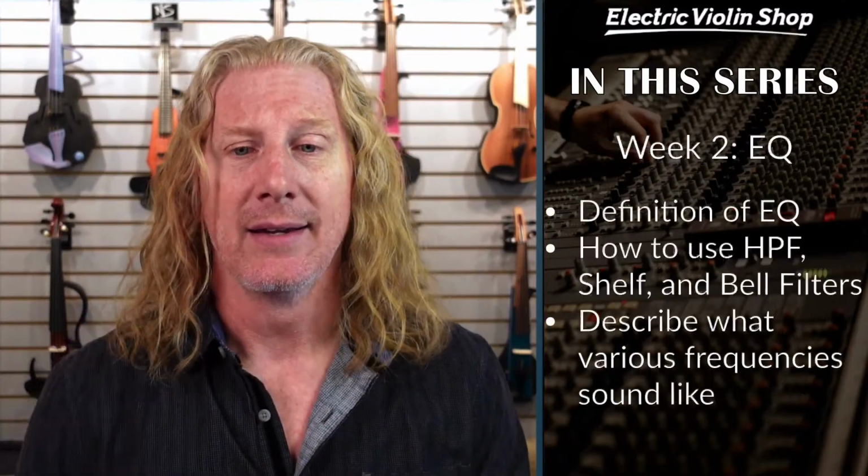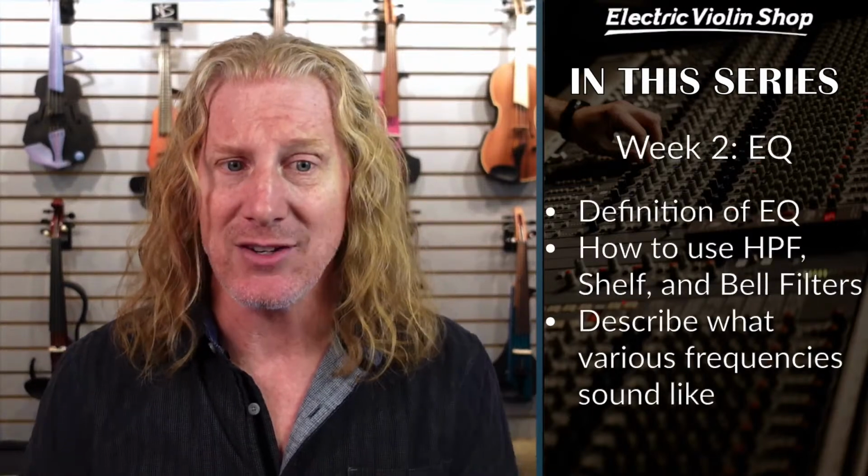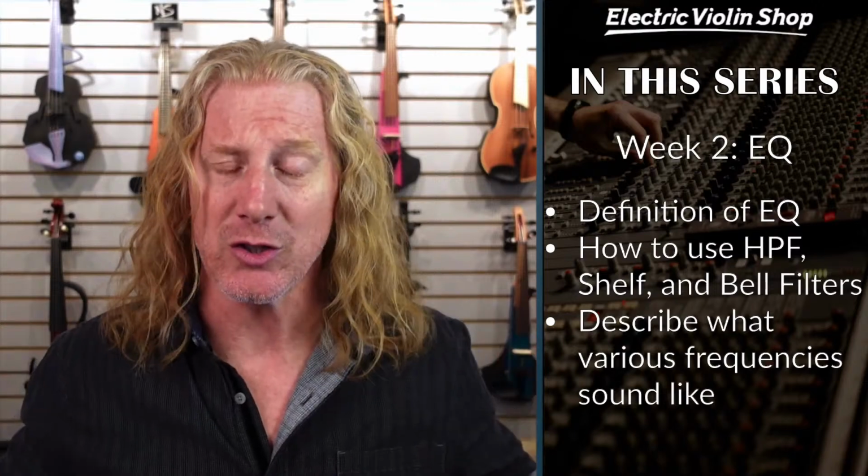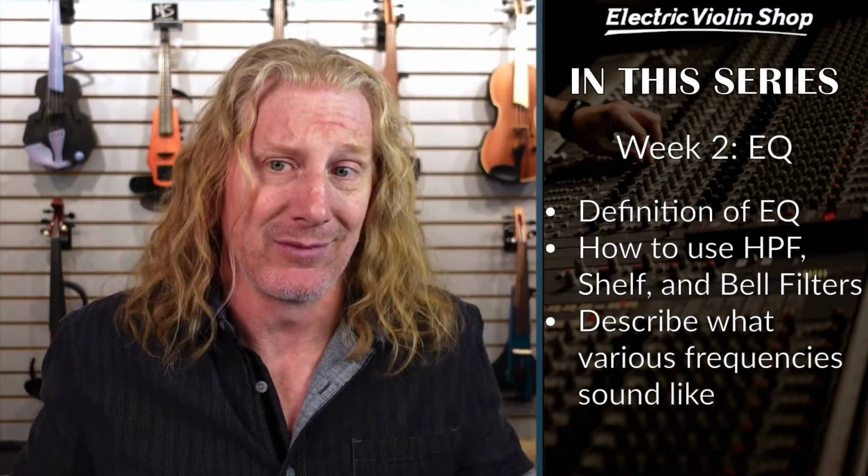Two weeks ago, week 1, we did gain structure. And while gain structure is not technically an effect, if you don't get gain structure right, none of your effects are going to matter, because gain structure is the thing that makes them all work right. So that was week 1. If you didn't see that, please go back and watch it. We say in engineering that gain structure is probably 90% of the battle. If you've got your gains all structured right, you're almost there in having a good mix.